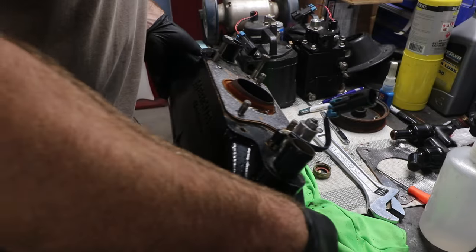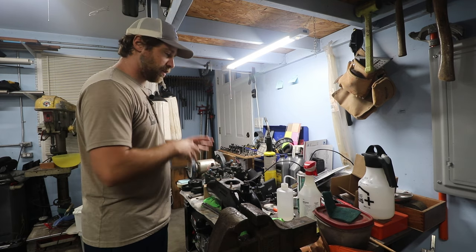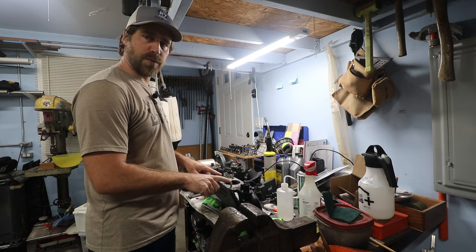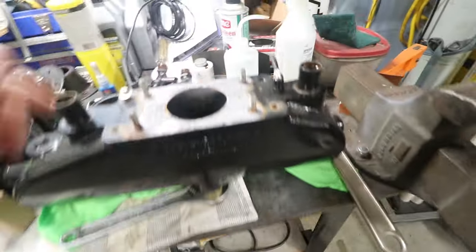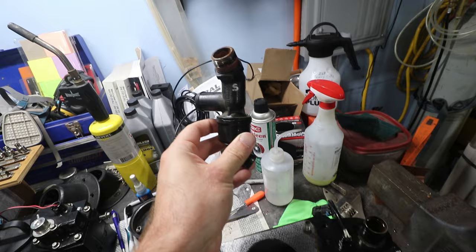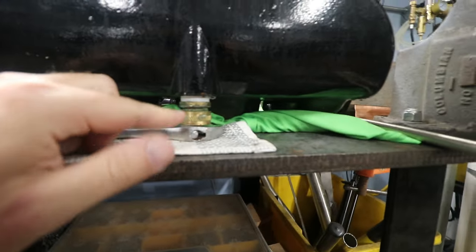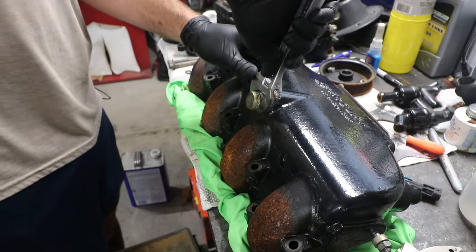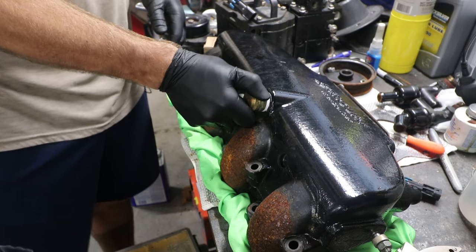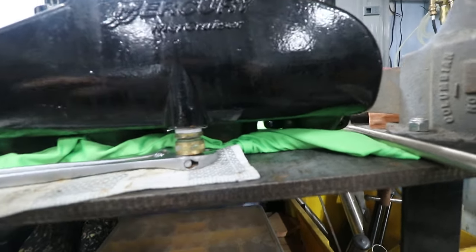We got the manifold up on the bench here. We got the first one sitting up here, I have it sort of leveled out. The piece that was in here is basically a check valve assembly for the air drain system. I removed that and discovered it's a 3/4-inch NPT port. I didn't have a regular 3/4-inch plug, so instead of buying something I used a garden hose adapter that was 3/4-inch and just put a garden hose thread cap on there — that seems to be working great. Threw a wrench under here to help level it out.